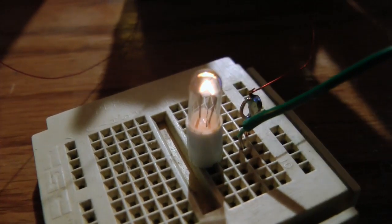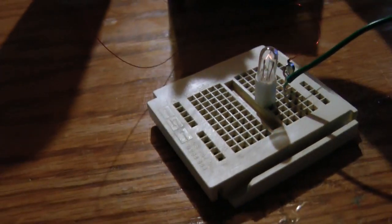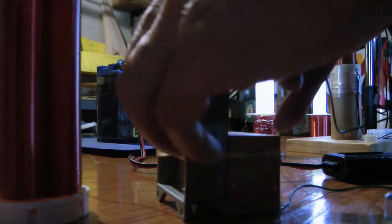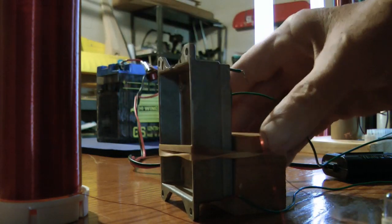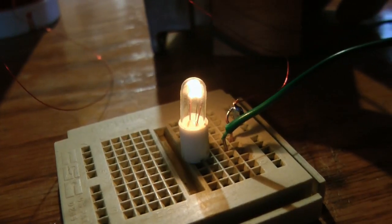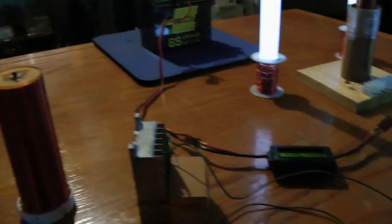This is a 12 volt bulb, and my hand is changing the capacitance as I tune. That's why I take this ground wire and set it up here. I'll just stick it in behind this heat sink - it's not connected with the bare wire, it's just laying behind there. Now you can see I can tune this a lot better with that on it. You can see that's running from the energy coming off of the Tesla coil being picked up over here.